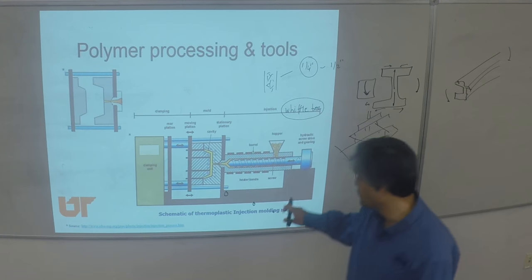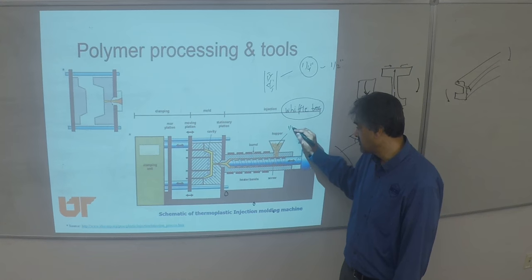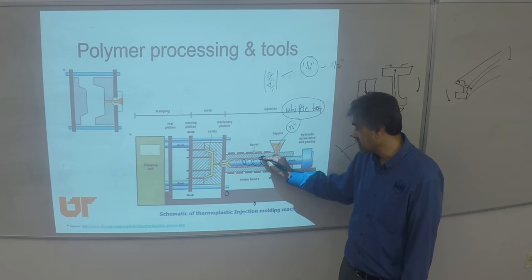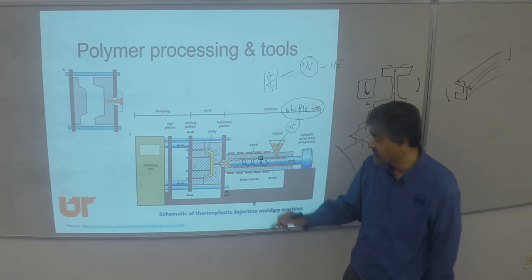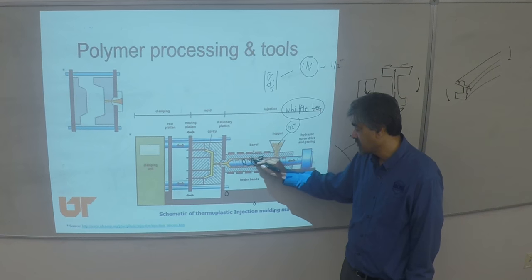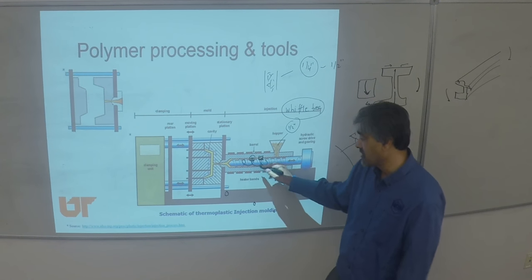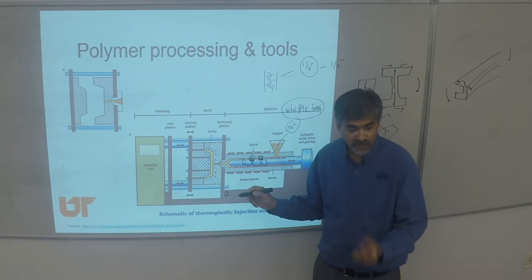In this zone you're feeding pellets. If you feed half-inch pellets, as they migrate through the screw, there's a lot of interaction of that fiber with respect to the shear wall of the barrel. The flight distance between the flights and the barrel causes the fibers to squeeze and start breaking. You get a lot of fiber attrition — that half inch becomes quarter inch, then smaller and smaller.